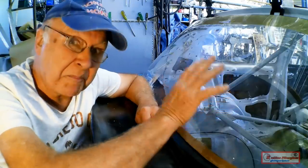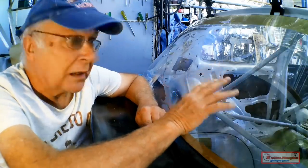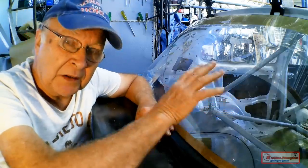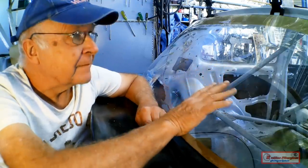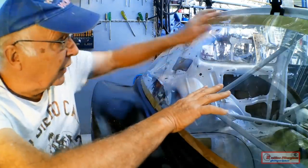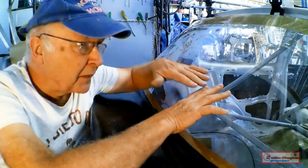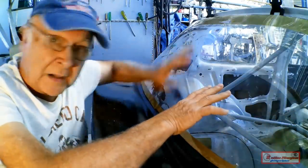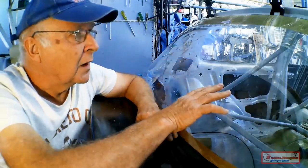I'm very happy with how both these rear hatchback clear plastic windows turned out. I wanted to make one in Lexan polycarbonate because I want to be able to drill it and use it as a factory glass, which hinges. And on the Civic, there's no frame around it, so the glass has to be strong.